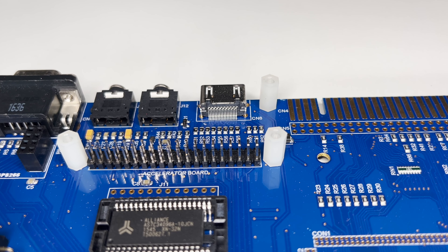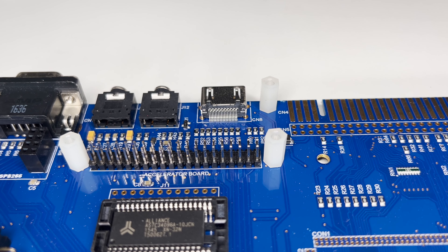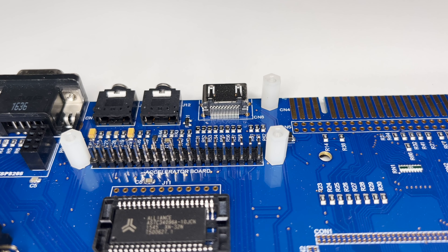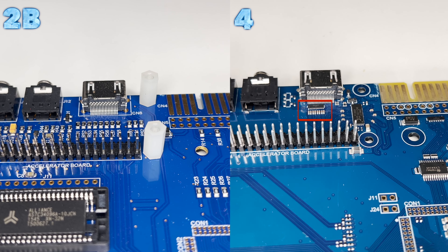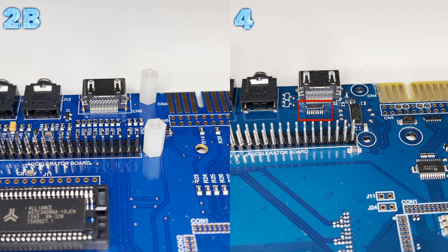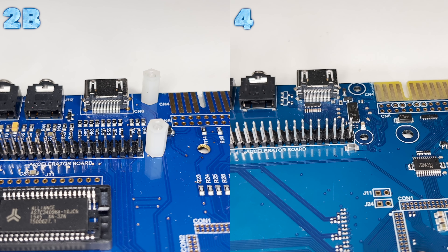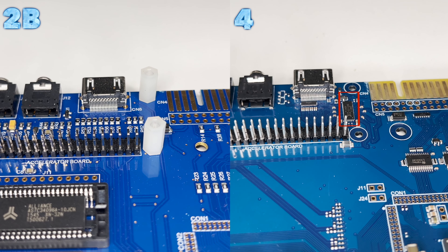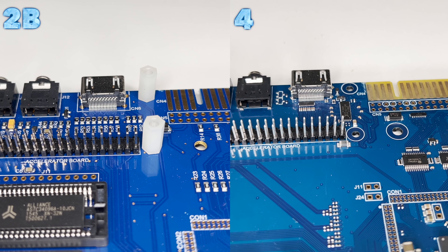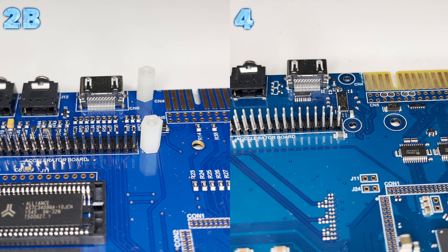Back power prevents the machine from fully turning off and can also lead to odd effects, such as the FPGA failing to reboot at power-up. To resolve this, series capacitance has been introduced onto the HDMI signal lines in order to block the DC power coming from the display. A dedicated IC, the PI3HDX12211, has been added that acts as an HDMI buffer and drives the HDMI signal off-board.